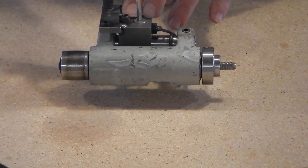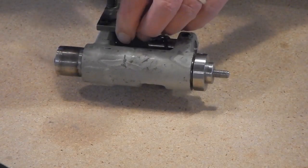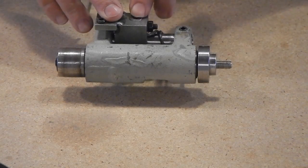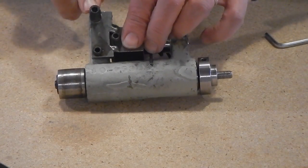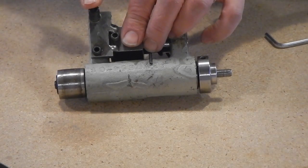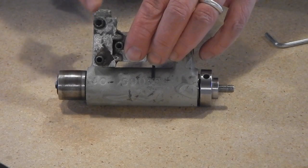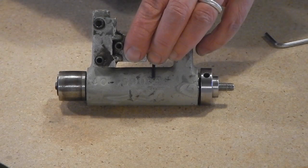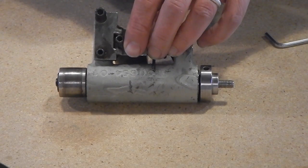The amount of left-right adjustment is about three millimeters or roughly an eighth of an inch. The center control is a simple lock that screws down and applies pressure on this shaft to lock things in place. The third control point is this screw, which is supposed to be used to raise and lower the scoring blade. This is where I affected my repair — this is not the original screw, it's one size larger. When I drilled and tapped that, there was very little metal left, and that has deformed along with the threads inside. Now this screw is totally frozen in place, making it non-functional, which means this block needs to be replaced.